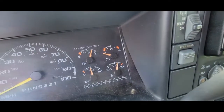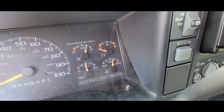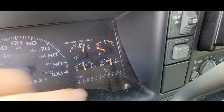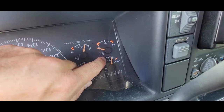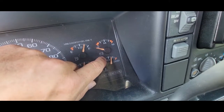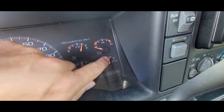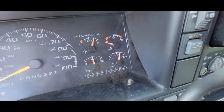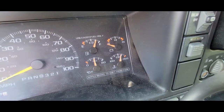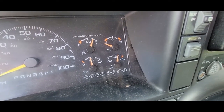And what's happening is your thermostat is jacked up. It's stuck, it's taking the extra heat, and finally it pops free and allows the coolant to go through it, and you'll see this go and then come down here and sit. But what happens eventually is this doesn't pop or release anymore. You get really hot and you either spray underneath the hood or you overheat, boil over. There's so many bad, damaging things that can happen because the coolant isn't circulating. It's something that's very common in these.